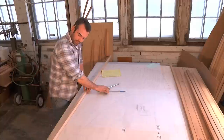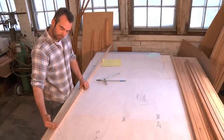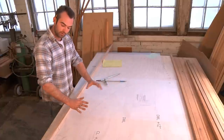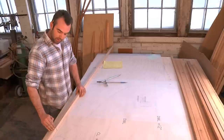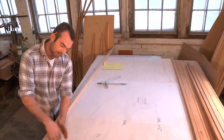The reason we're doing this is because we need the bevels on the bottom of the frame where it hits the keel, because we're steam bending them inside the hull and that needs to come all the way down. If we didn't put this bevel on, it would come square and we'd have a big gap down at the keel.